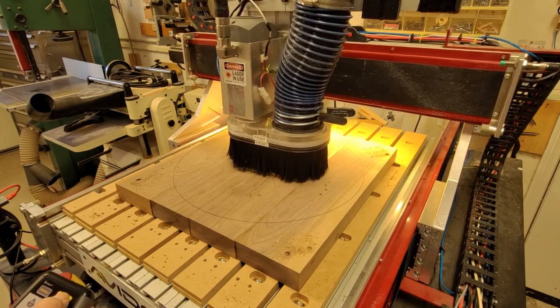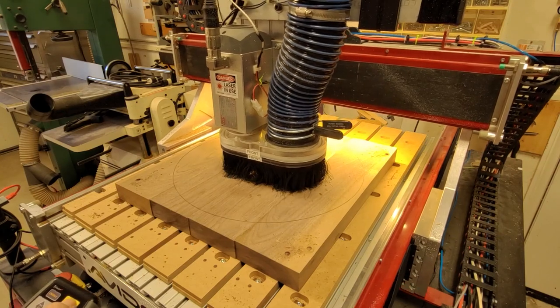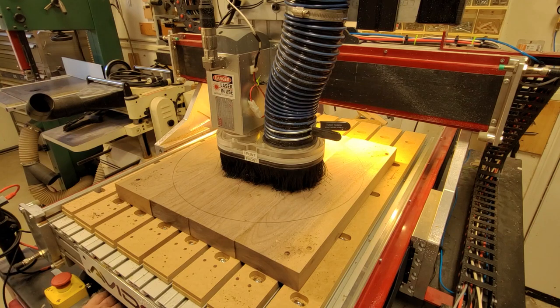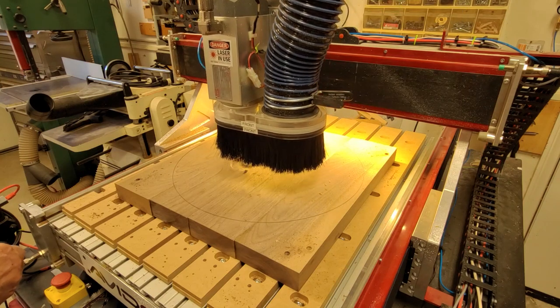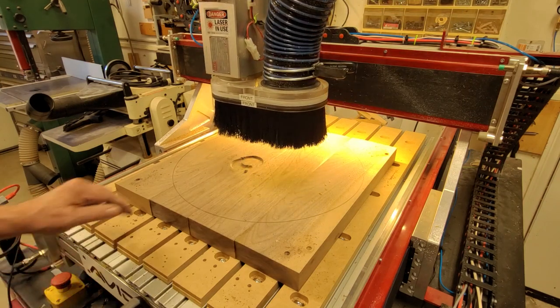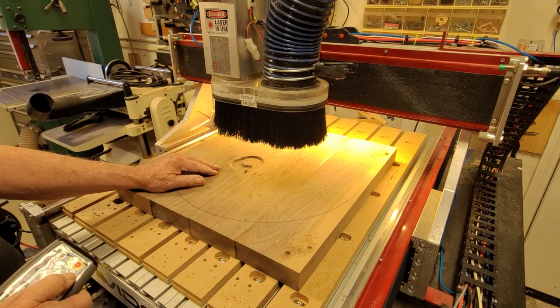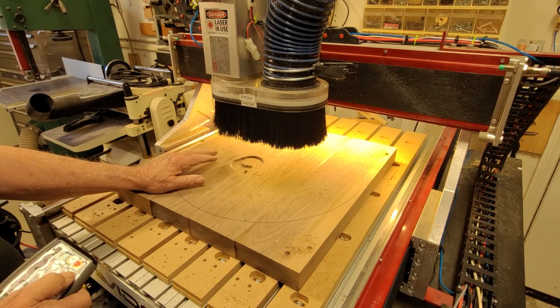Okay, what we're about to see is what happens if you don't do a lead-in. And I had to stop it. And you're going to see that it wasn't able to continue. The lead-in eliminates that little piece in the middle of it. It's causing it to jam up. So if you do a lead-in, then that completely goes away and you don't have the problem. So on the next video, you'll see we added the lead-in and we're all fine.